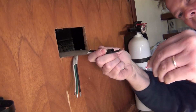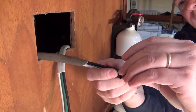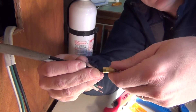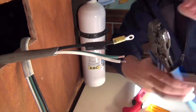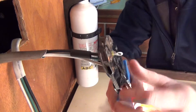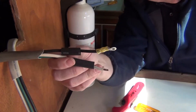At this point we've already talked about the fact that this is our incoming, so this is our line. We're going to heat shrink and butt connect each one of these conductors. Put it in, give it a twist, fit it snugly, then we will go ahead with our crimping tool and give ourselves a good crimp. We're going to repeat that for every other conductor we have coming in on the boat.